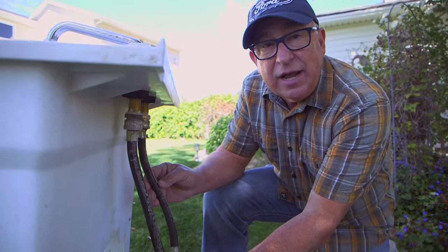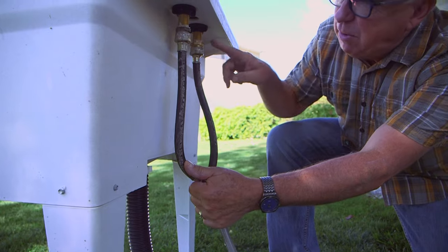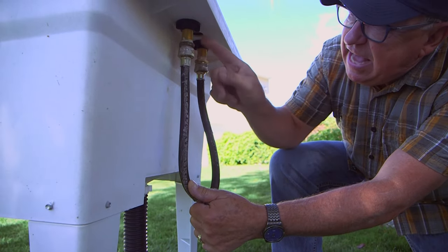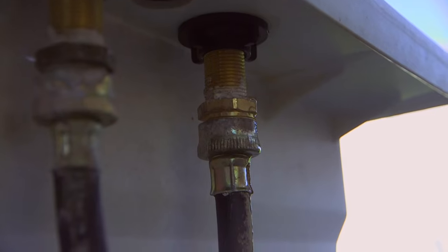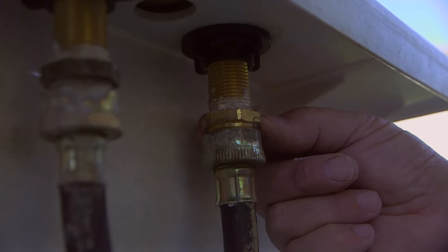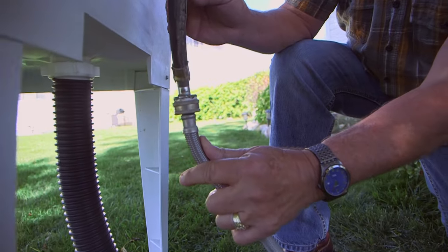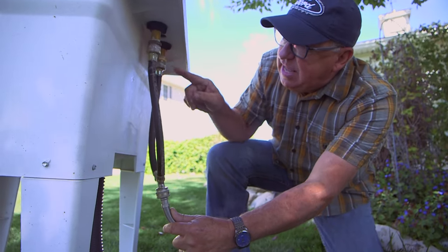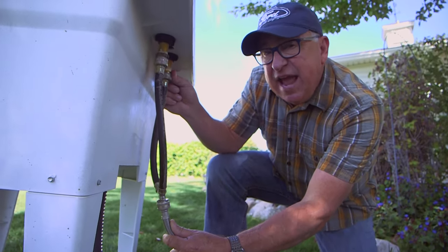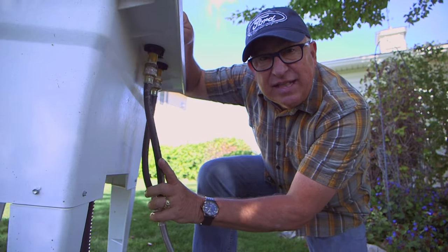Now that we've covered an enhancement on the drain side, there's an alternative way to plumb this that is a little more economical, but there's a trade-off. If you recall from our earlier video, this is plumbed by attaching to both stems of the valve up here — standard one-half inch pipe thread — using an adapter to change it to hose thread, with a standard Y adapter commonly used in laundry settings. We can instead go direct to one side and cap the other side. The disadvantage is that only one valve will work, but if that's all you need and you want to save a little money, that's fine.